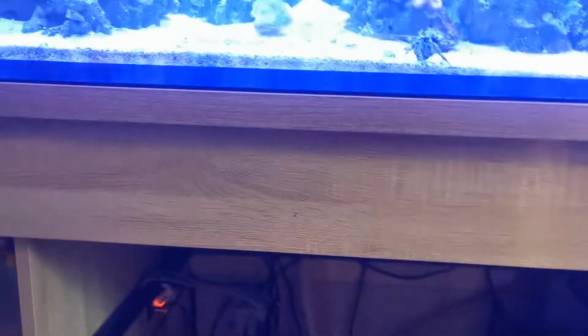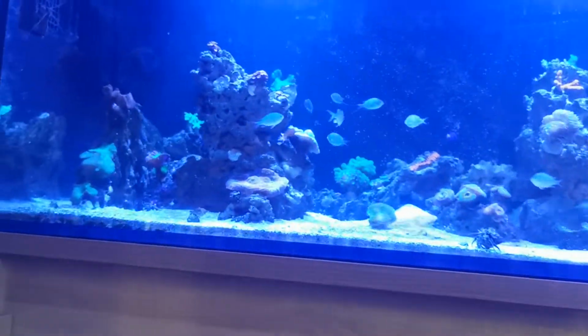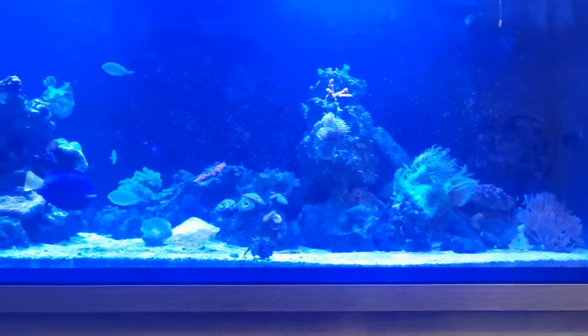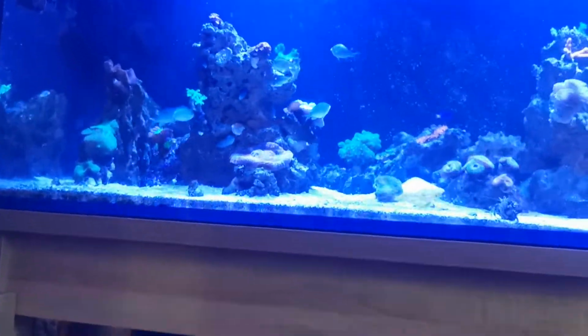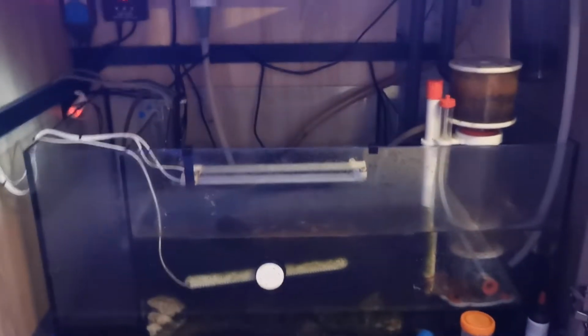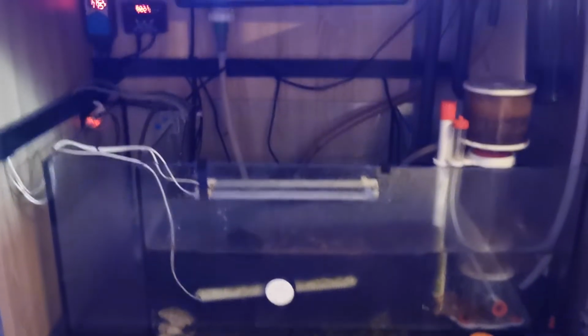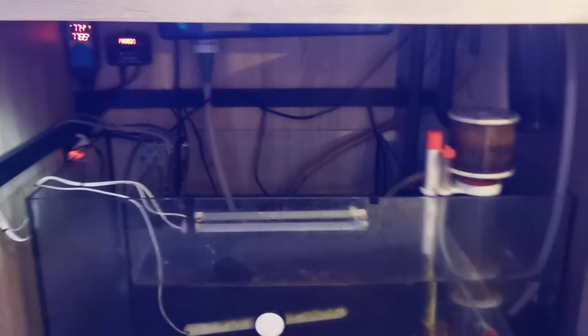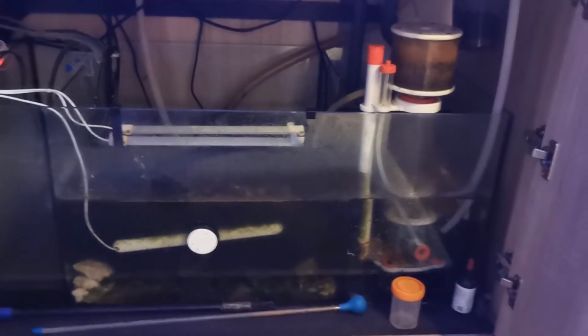Now the RCD on its own won't really protect you. It has to detect a path down to earth. Unfortunately, that could be your hand. If you've got a heater that's cracked or a bit of kit that's going, it will only trip when it gets a route down to earth, so it will go through you, because it links up to the earth of your house, which is a bar which is buried out somewhere outside your house.